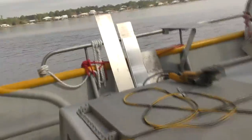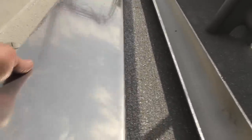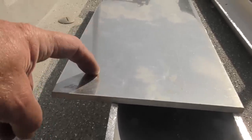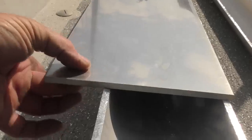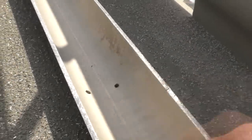Now on to stiffening this up. We're basically going to make it like an I-beam. I got this material at a local fabrication shop - some 3/16 and some quarter inch, and some 3/8 which will be used for pad eyes if I need that. This stuff will be used for the stiffener. The idea basically is to weld it in, put them back together, and weld the other half on. I'm going to let it stick down below the yard and drill holes through it - that's where the sail will get bolted on with its grommets.